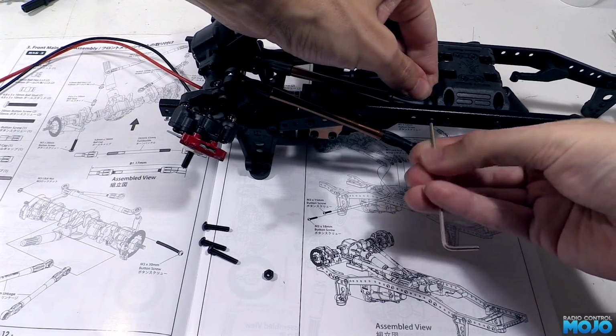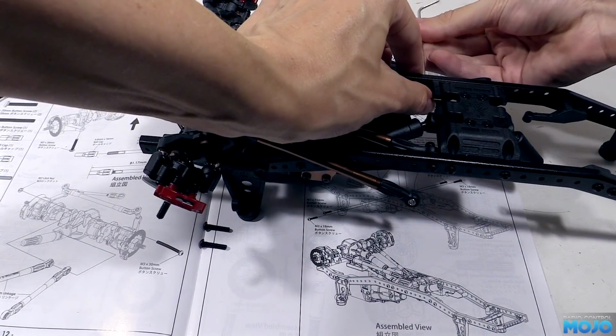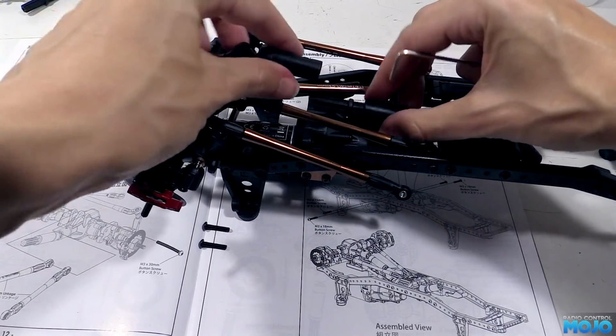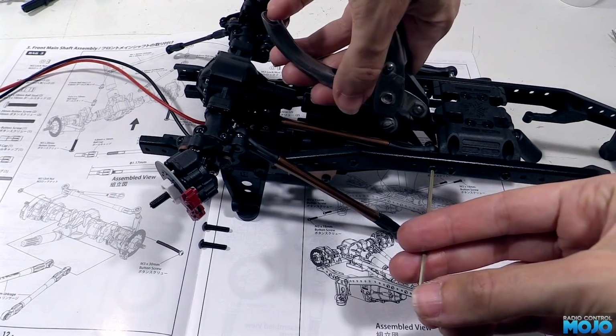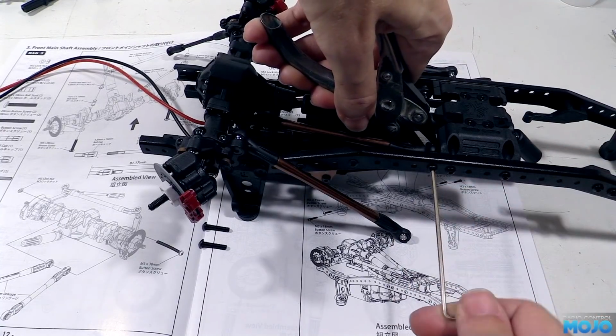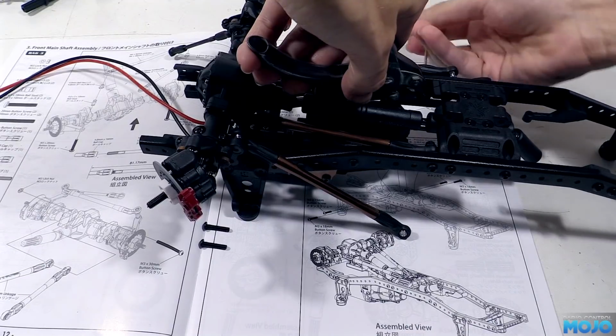To keep it on, we use one of the nylock nuts. For now, we'll just do it up finger tight so it's not going to fall off while we fit the other one. Now the assembly is somewhat stable, we can tighten up the nuts. You might be able to get away with a small cross wrench, but a small spanner or parallel jawed pliers makes it really easy. We only need to do them up so they're snug, plus a little bit extra.